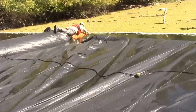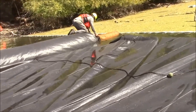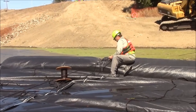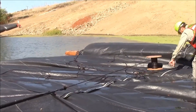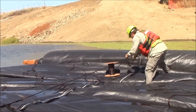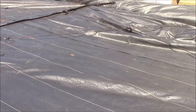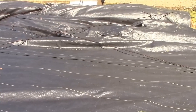The rope is being passed around the end of the aqua dam log. It will be used to completely encircle the aqua dam, which we will tie off to at a later point to stop the aqua dam from rolling out. Now that the circular rope has been connected to itself, we are cutting tie-back ropes to tie the bottom seam of the aqua dam back to the encircling rope. At that point we will allow this temporary holding rope to break or we will cut it, and then the aqua dam will roll forward until held back again by the new set of ropes. So all these ropes acting in conjunction will hold back the roll of aqua dam as it continues to fill.